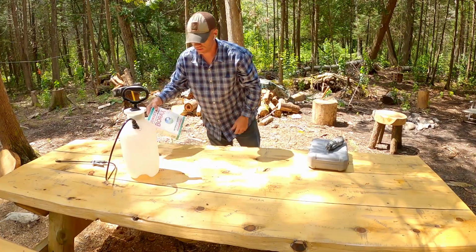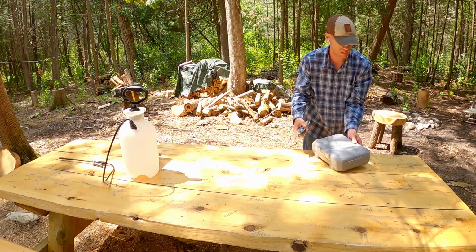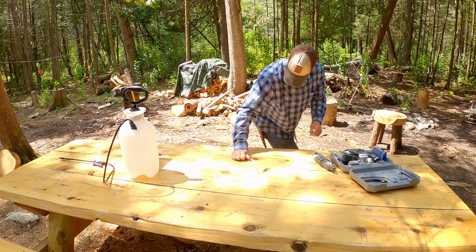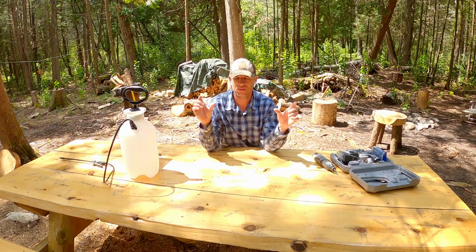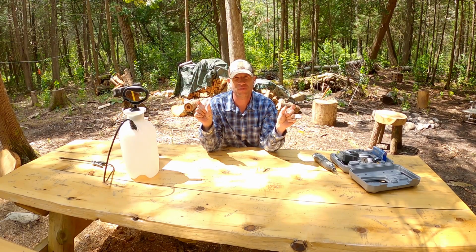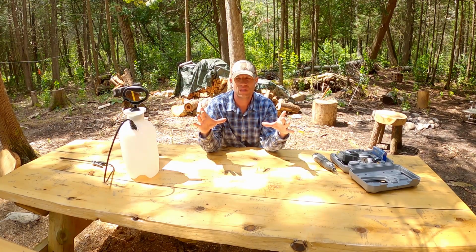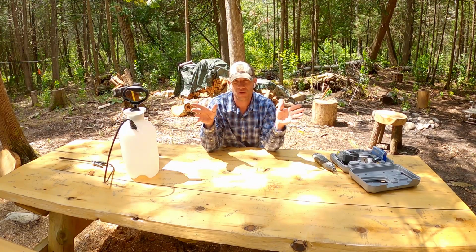That's the only thing I could find out where I am that would treat the wood and maybe kill off some of the bugs. There was a lot of that wood, it's all blowdowns, and the outside, maybe a couple inches of several of the logs had bugs in it, but the inside, you still get, I don't know, 12, 14, 16 inches of wood on the inside. That's perfectly good. So I'll trim most of the outsides off of each board, but in case there's some bugs that made it past that part that I trim off, I'm just going to go ahead and treat it all.